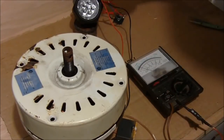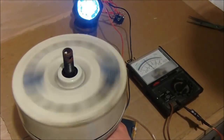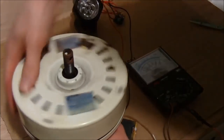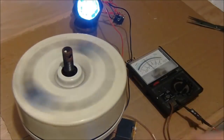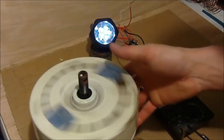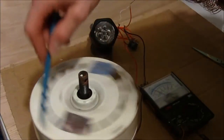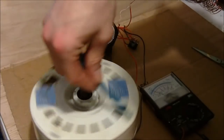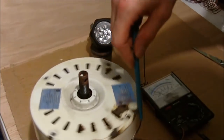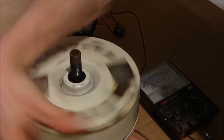I took the capacitor that was out of the motor and I've just hooked it back in with the output, just trying that to see if it works better. It seems to be holding the voltage longer, so it's actually better to put that capacitor in there. The generator will work in both directions — clockwise or counterclockwise. That's good for a generator that you can build without a propeller, one that just sits on the ground and spins, and if the wind changes it'll produce in both directions.